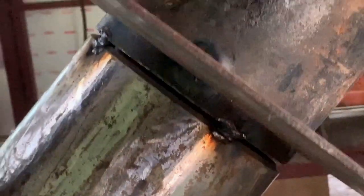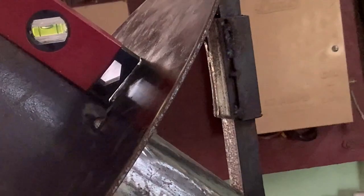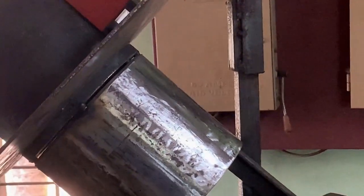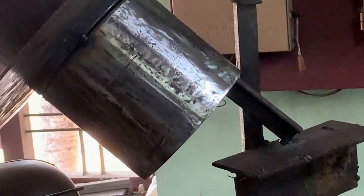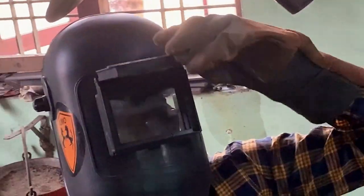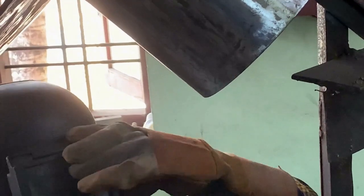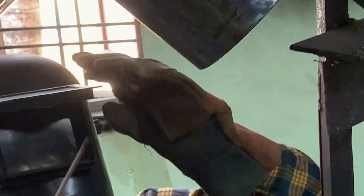After positioning it at 45 degrees, you can see the difference from the inside — the 5 millimeter difference can be seen. And now you are ready for the welding. You can start the 6GR test. You are ready to start now and become a 6GR qualified welder.